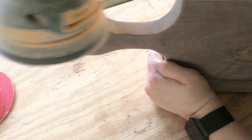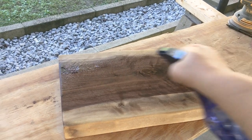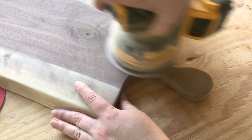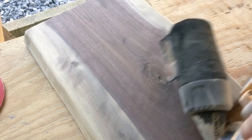I'm giving it a really good once-over with the sander. Once I'm done with the 120 grit, I spritz it with a little bit of water all over — the sides, the top, the bottom. What this does is make these fine little wood hairs rise up out of the wood; you can kind of see them close up here. Once it's dry, I switch to 220 grit and start sanding again. This gives it an ultra-smooth finish, and I hit all the corners, sides, and around the handle.